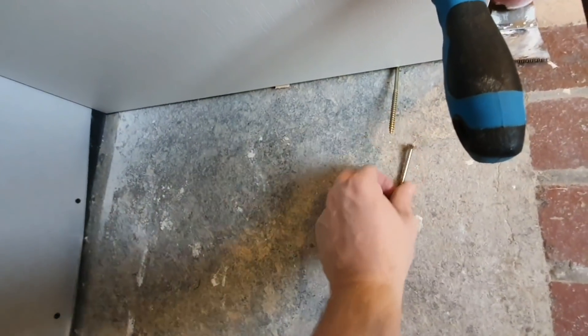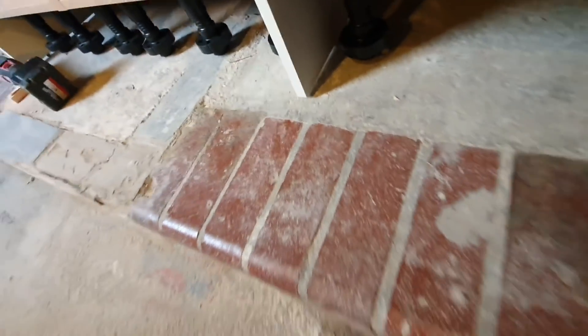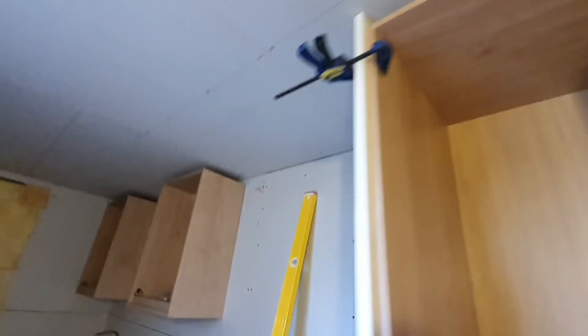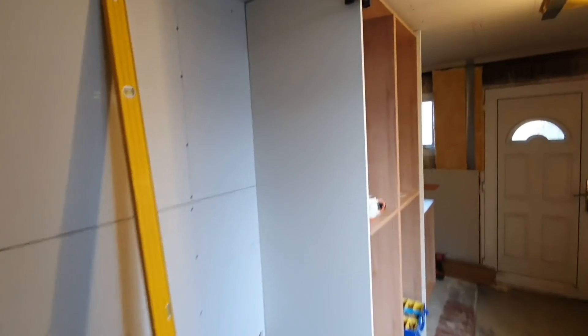Make sure you've got a little gap underneath - I've used a screw as a little packer so when the plinth comes through it'll slide nicely underneath. The end panels are pretty tight up to the ceiling - I haven't had to cut any off them. I've measured the ceiling to near perfection - there's a tiny gap but I'm really happy with that.